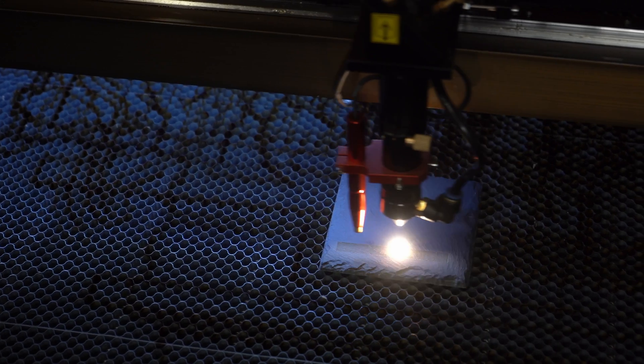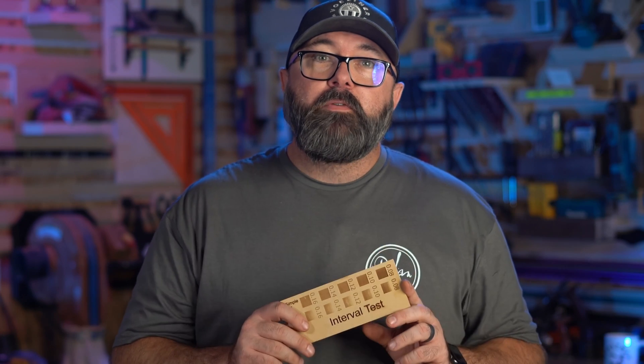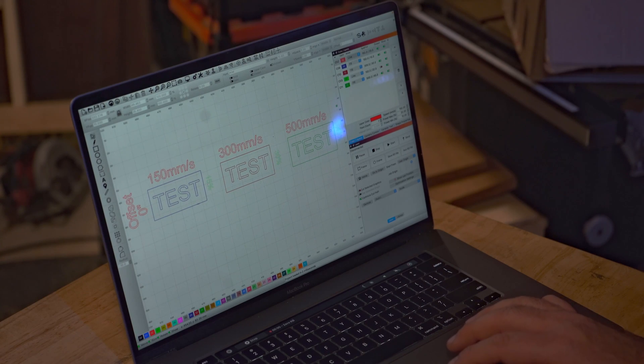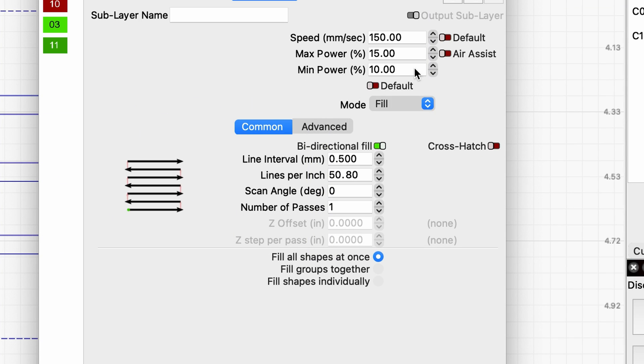As the laser starts to travel, there may be a slight delay in the amount of time required for your laser to fire and stop, resulting in sloppy lines that make your image have ghosting on the outside. The faster you run your speed, the more exaggerated the result is. If your best looking interval from the previous test was 0.1mm, let's assume you spaced out that interval to something like half a millimeter — this is to show you that you may not be getting as clean of an edge as you think you are.